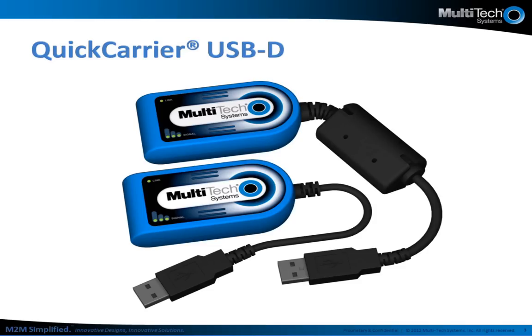Here you get a quick look at the Multitech USB Cellular Dongles. We offer two models: a 3G pentaband HSPA Plus model and a 3G dual-band EVDO model. These models include an internal antenna, are powered via the USB connector, and on the HSPA Plus model we provide signal strength LEDs. The devices are small and compact and styled similar to other Multitech devices.